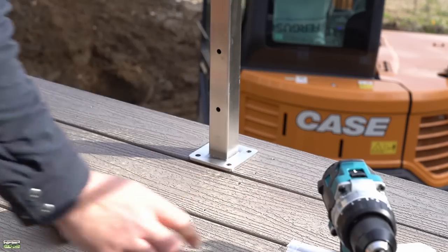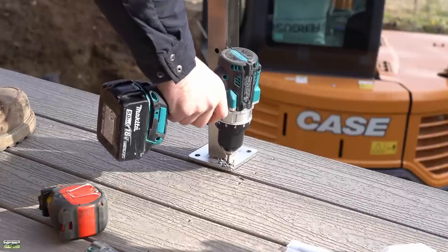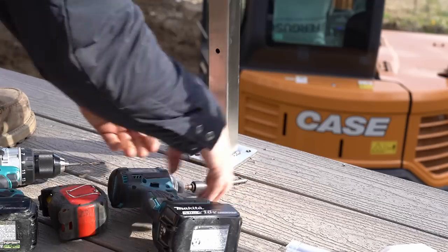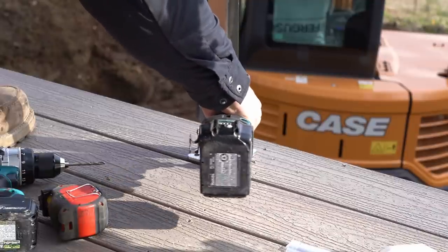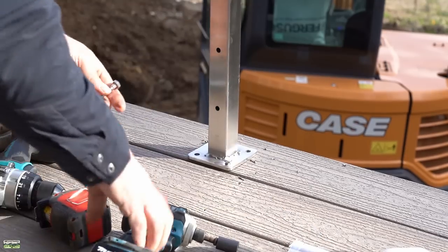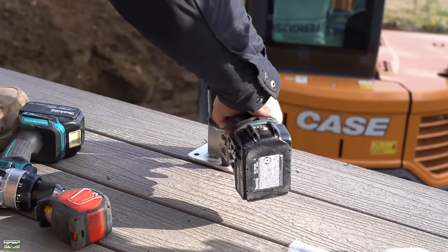Because I have 4x material underneath, I'm lining it up with that edge of the decking. It's just four lag screw connections, so pre-drill it. What I found is that if I installed them but not tight, it allowed me to move the post to plumb based on the order that I tightened the lag screws. I put one in the bottom right corner, then go to the top left corner. These posts are made with a slight curve in that base plate so that you can humor the post to plumb — h-u-m-o-r — humor the post to plumb. Really simple with an impact driver.